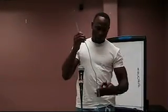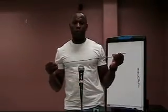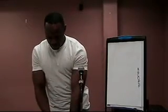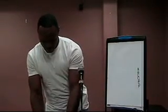First thing you need to do is get the desired length of cable. Measure the cable and use your cable cutter to cut the required length. Now that I have my required length of cable, the next thing I'm going to do is use my cable stripper and strip the end of the cable, placing the end through the wire stripper. Here I've stripped my cable.